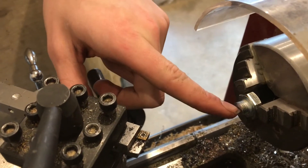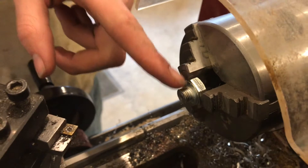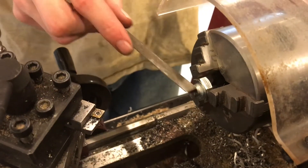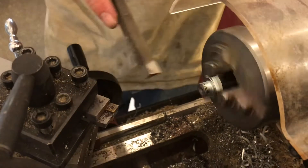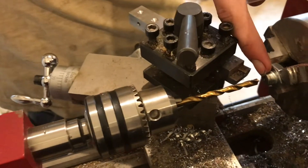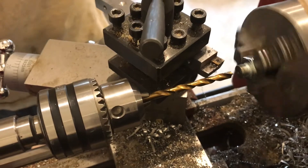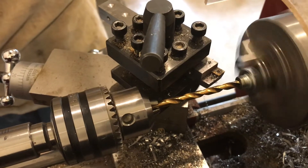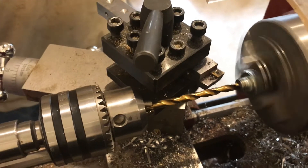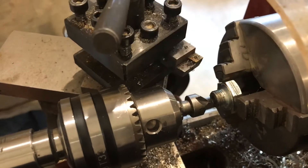After facing this portion you can see that the hole did go all the way through where we needed it to, but at the end because of the tool the threads are a little bit messed up, so I'm going to use a file to clean up that edge, add a chamfer, and make sure that the threads are good. Although the hole comes through the other side it's just a little bit, so we're going to clean it up with the 3/16ths bit again. Now it goes all the way through. The last operation here will be countersinking to clean it up.